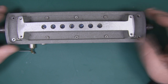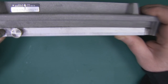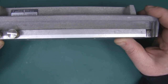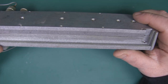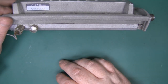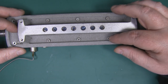Let's take a closer look at this transmission line slash attenuator as described in the patent from 1961. Just before I pop the top off, I wanted to show you the milling around here - there's a bit of a lip and it doesn't look to be the best kind of accurate milling you would expect from Agilent/HP, even with their test equipment from the 1980s. The quality just wouldn't actually look like this. There's a big lip on the opposite side as well. I don't know how this actually affects the unit or whether it's really sealed on the inside where it matters, but it looks a little rough around the edges. Unfortunately, the Torx screws that hold the two halves in place have been in there too long and are actually seized - there's no way I can get these Torx screws out without drilling them out, and I really don't want to do that.